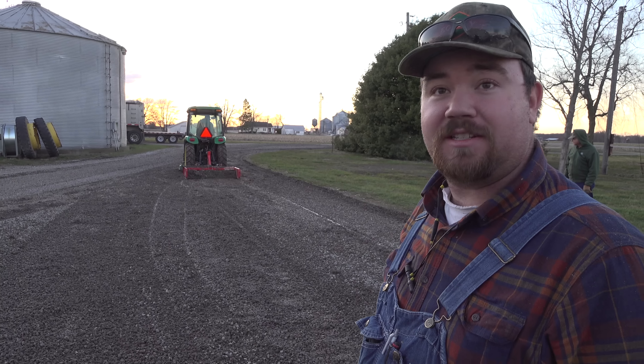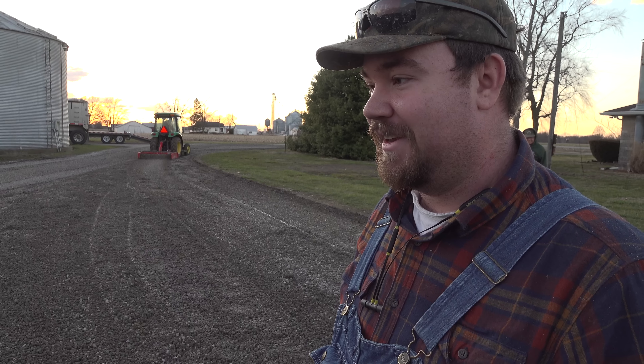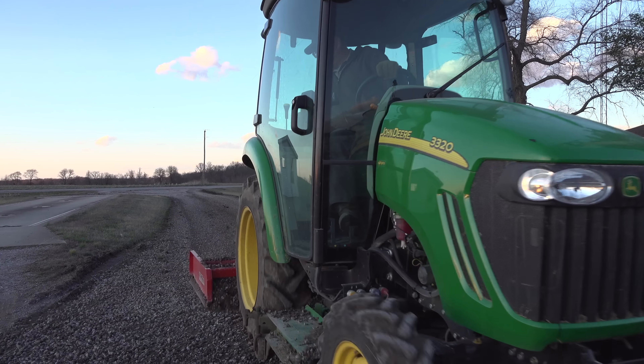Asking Randall after about 15 minutes of running it, he says it does a nice job. It likes drier ground better than wet clumpy ground. If it's really dry it's too hard and it scatters rocks on top instead of cutting — it starts dumping them when it won't cut. As for technique: leave it down instead of trying to leave a pile where you want it. You've got to scatter it out over a long distance if you don't want to leave a pile, but it takes a long distance to dump it out. You can raise it up an inch or so to spread rock right out.